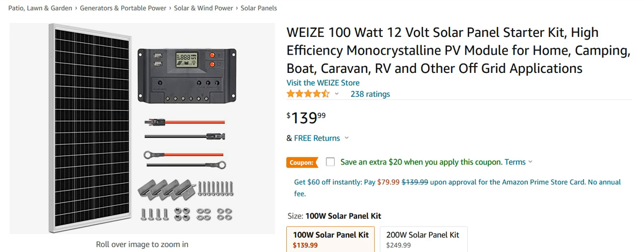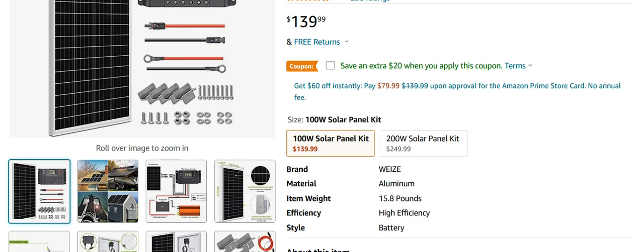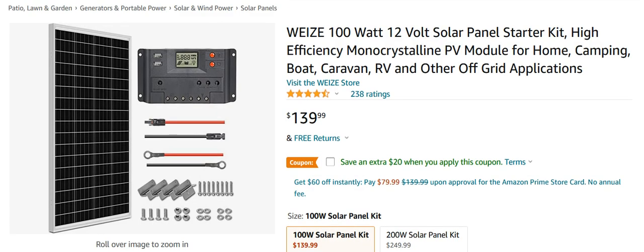And if you look at this here, it's $139 and I think it might be free shipping. This is from Amazon — it's 100 watts. So this particular panel, using the same example of a 46 amp hour battery, it would take approximately 8.6 hours to charge that 46 amp hour battery depending on how low the battery gets. If it's really dead, it's going to take about 8.6 hours to charge.